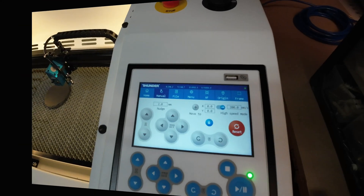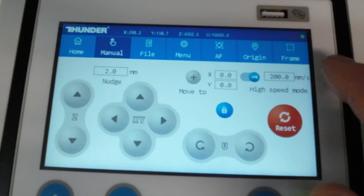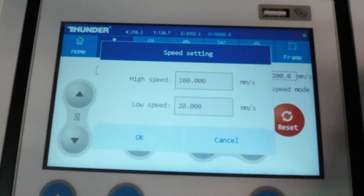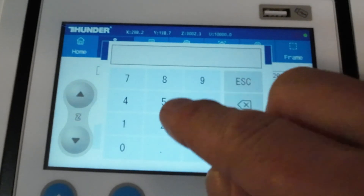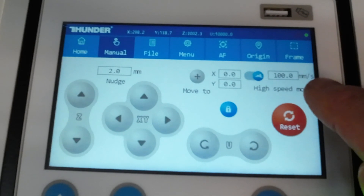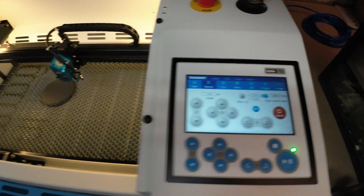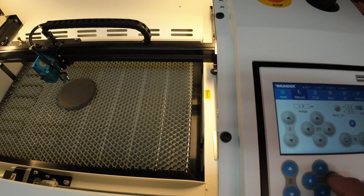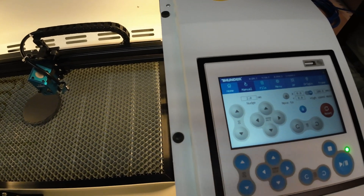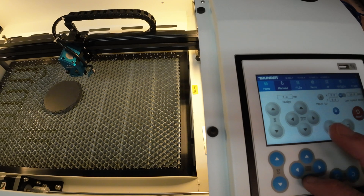But that's not all. These settings for your rabbit and turtle speeds are user-definable. Right now I'm on fast — if I think that's either too slow or too fast, I can adjust the high speed to 100 and adjust my low speed to 10 to make it even slower. I press OK and now my high speed is at 100 millimeters per second and my low speed is at 10. It takes immediate effect on the movement of your laser. That's a much more comfortable speed for myself, and if I put it to the turtle setting, now I've slowed it down to 10 millimeters per second in either direction.